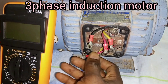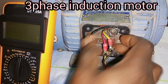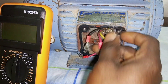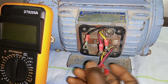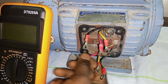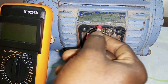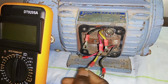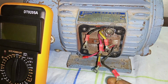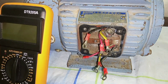In this particular motor, you have three wires that are the beginning of the windings and then three wires at the top that are the end of the windings. The wires are color-coded: we have red, yellow, and black. So we expect that the red wire is the beginning of the first coil and this is the end of that coil, then yellow is the beginning of the second coil and this is the end of the second coil, then the black one is the beginning of the third coil and it has its end at the top.